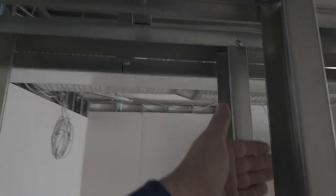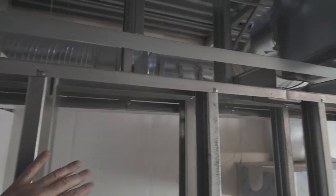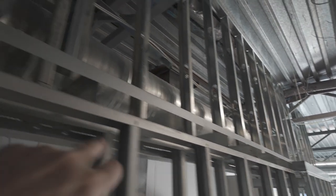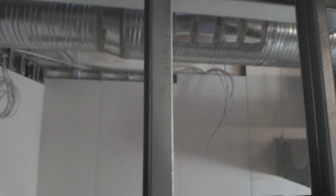There's a process to doing this - you have to do the back bulkhead first before the front one. I go this way and then back, and I stagger my 10-foot pieces of track - the first 10-foot joint is down there and this one is here. When you're doing this first back bulkhead, you can screw in both the front and back of the stud on all sides. On the front one you can only screw the fronts - you won't be able to get a screwdriver in the back - but that's fine because the back one is solid and when you drywall you're screwing it in on the front side.